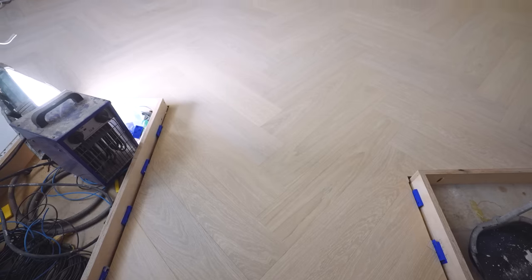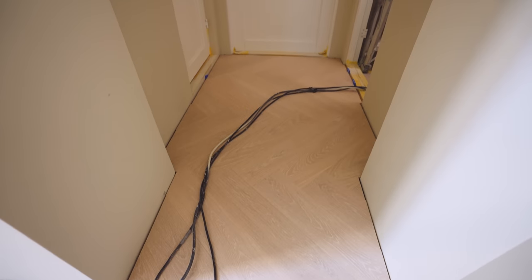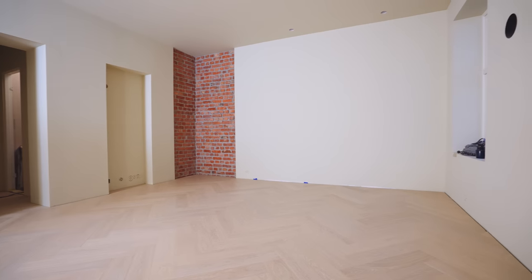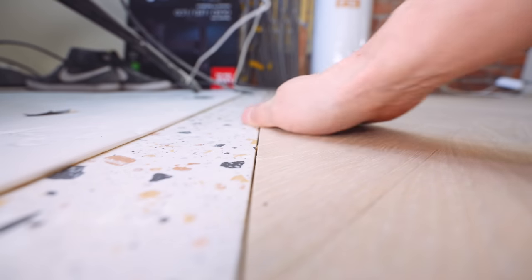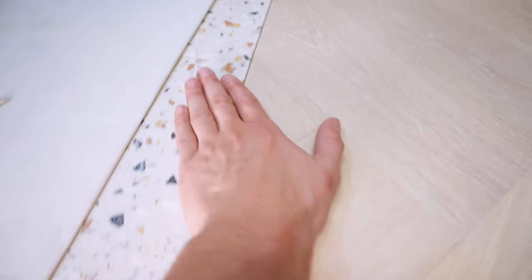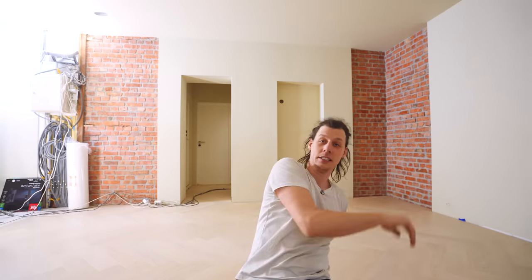If this doesn't look like an actual living room and not a construction site, I don't know what does. The entire floor — living room, kitchen, hallway — everything's done and completed. Obviously we'll still need to trim around the edges to cover the gaps. The transition to the tiles turned out super nice and even, very flush. We still need to fill that gap with some construction adhesive or silicone, but I'll leave it like this for a little bit just to see if it moves around. Although this room is completely done, we still have two rooms over there that are far from finished — we still need to do all the drywall work, painting, and laying flooring in there. That means a lot of dust and stuff that's going to be placed on the new floor, so it's time to cover it all up.